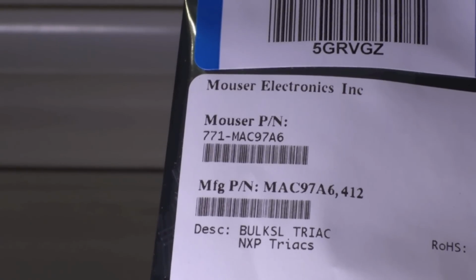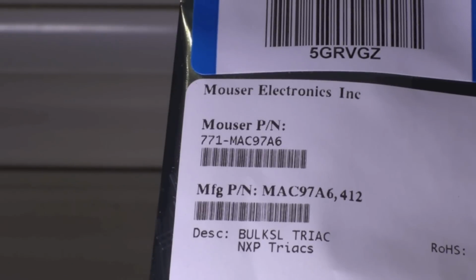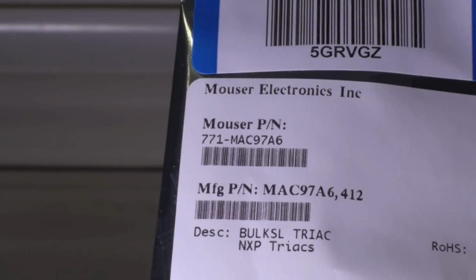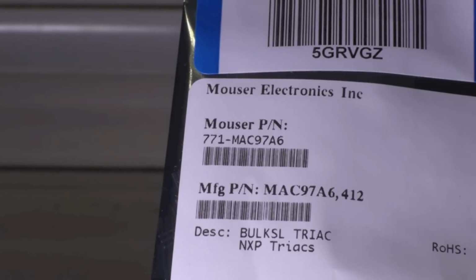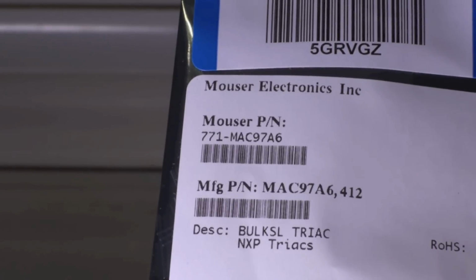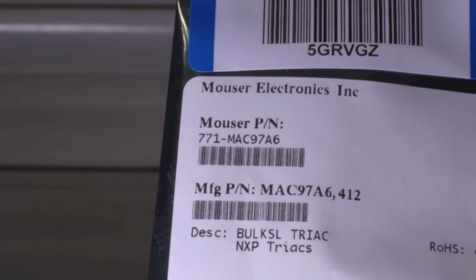He gives some kind of neat directions. I have to give him that, but boy, that's an awful lot for that thing. Because the wax motor, I bought it retail for a little over 12 bucks. I've seen them on Amazon for $4. And then I've got, I don't know, 8/100ths or 8/10ths of a cent or something for the resistor. And about 40 cents, I believe, for this triac. So I just went ahead and bought them, and I'll give it a shot. Old washing machine, it don't make it. But not going to put a lot into it.